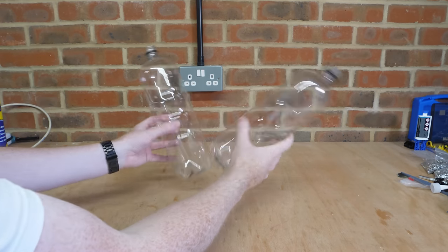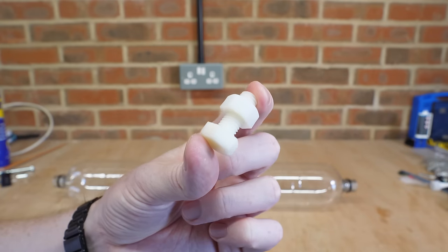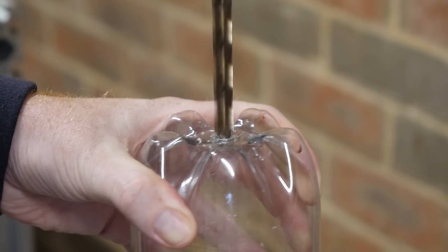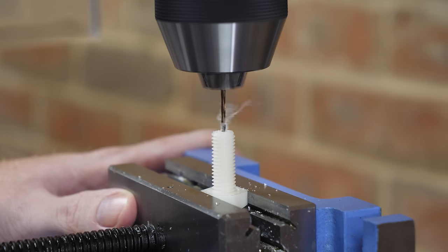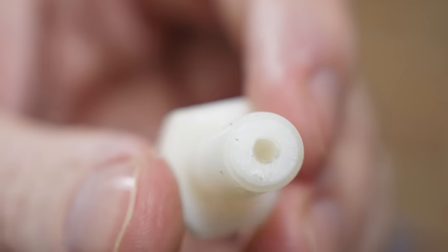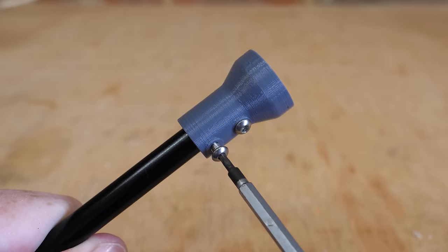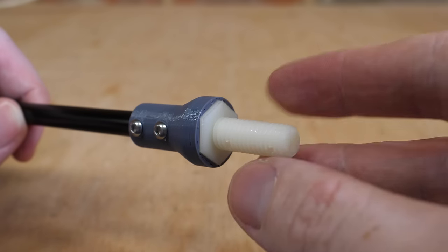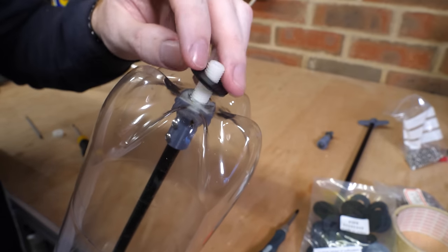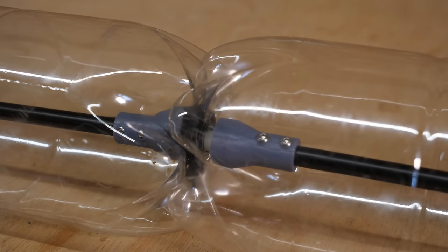To increase the runtime, I'm going to mount two 2-litre bottles back to back using a nylon bolt. This requires drilling out the underside of the bottles — the thickest part — which shouldn't reduce strength by much, as well as hollowing out the nylon bolt. To attach the bottles together, I get the nylon bolt inside the bottle using a cut arrow shaft with a 3D printed socket, which squeezes through the bottleneck. This lets me sandwich a large rubber washer between each bottle before tightening it down with a nylon nut, which should create an airtight seal.